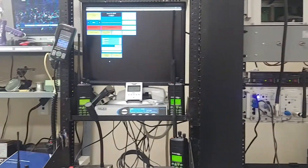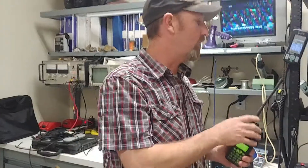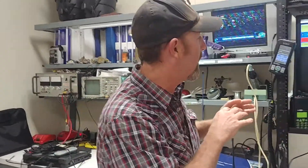When you do broadcasting, it strips all the data off of what's being passed over the radio network. When you do Digital Fixed Station Interface control, it does not strip the data off. So we're going to get capabilities like knowing which units are calling, using the emergency button on the tops of the radios, text message capabilities, unit log recording capabilities, and a whole bunch of other stuff. If you go the other way — not only are you non-P25 — but you strip all that data off, and so all the advantages of going radio over IP have just been stripped off.